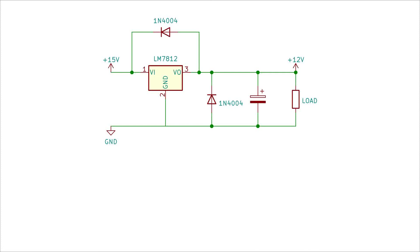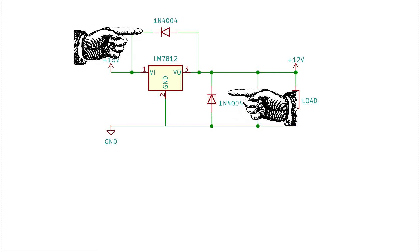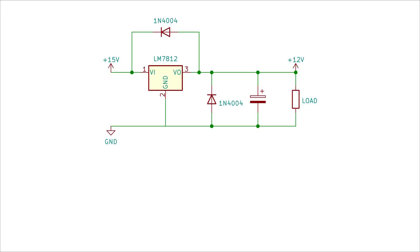I want to show you a portion of the schematic around the positive power supply regulator. On the left, the unregulated voltage comes in on pin 1 of the voltage regulator chip. Pin 3 is the regulated 12 volt output, and pin 2 is connected to ground. On the right I've shown a resistor labeled 'load' representing the synthesizer modules. There are a couple of 1N4004 rectifier diodes discussed in Texas Instruments application note AN-182 — I'll put a link in the description.